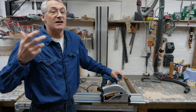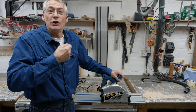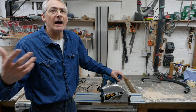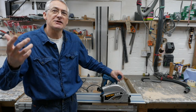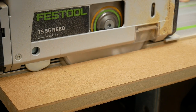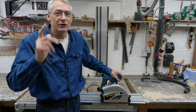The other thing is that by having less blade in the material, the blade is working less hard, so your blades will last a little bit longer. As always there's an exception to this rule, and that is for plunge cuts — where you're cutting on the inside of a board doing a cut-out. For those you need to be plunging at the maximum depth, and there's a very good reason for that.